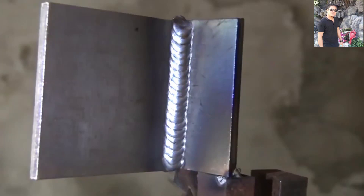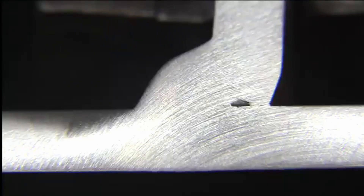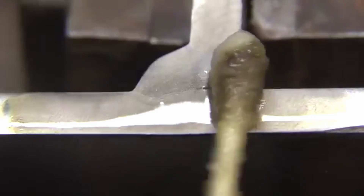Let's take a look at that — it looks pretty decent for vertical uphill. We're going to cut and etch it to see exactly how much penetration we got. I want to slow the arc down to about half speed and watch the technique again: come straight across and then come right up into the front edge of the puddle with a short stick out using a series of triangles. It might be more like a teardrop shape, but either way I'm whipping across the middle pretty quick and moving it up in increments to keep the arc in the front of the puddle.